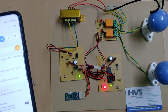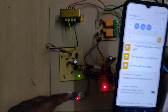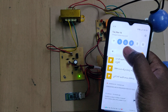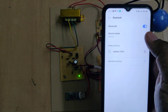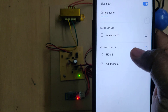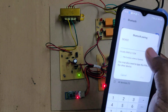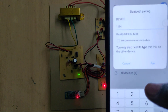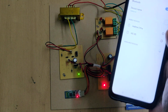Once the supply is given to the system, there will be a light indication of two blinks on and off. After that, the Bluetooth module will continuously blink. Go to the Bluetooth settings of your phone and pair a new device. Wait for available devices — it's HC-05. This pairing is only required the first time on each phone. The pairing password is 1, 2, 3, 4. Once successfully paired, that's all that's needed initially.